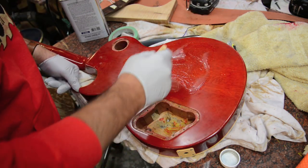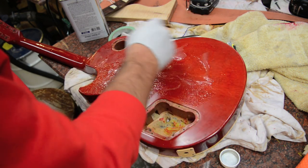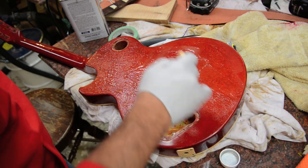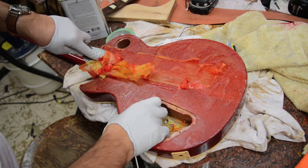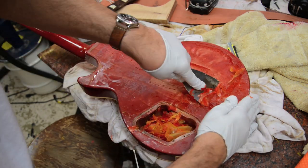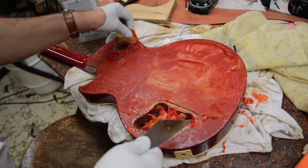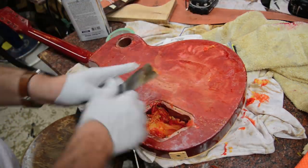I'm going to speed up the video here a little bit. The video gets pretty messy and this probably took me two hours to get the body clean — a lot longer than I originally thought. At one point you'll see after I use all the stripper it's just a complete mess. We'll get the stripper all over the body, and about 20 minutes later we'll start to scrape it off. You can see it comes off in just a bunch of large chunks — the more you put on, the easier it comes off. In a couple strokes I've got most of the finish off in terms of the large thick pieces.